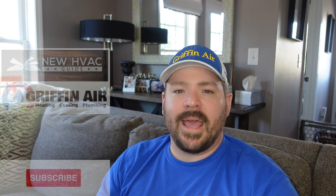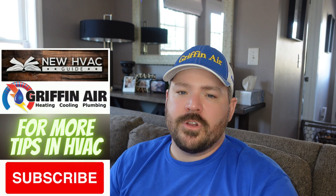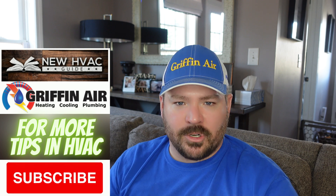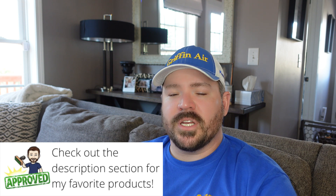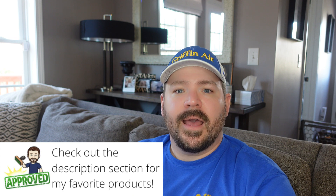For a lot of our customers that have batteries, I'll tell them every New Year's Eve or every Fourth of July — just pick something on the calendar you'll remember — and change those batteries. Every New Year's Eve I go through my house and change all the smoke detector batteries, and if you have batteries in your thermostat, that should be one of them as well. Just once a year, get fresh batteries in there and you'll never have to worry about it. Also keep in mind, a lot of thermostats have sensors — outdoor or indoor temperature sensors — that are also battery operated, so make sure you're replacing those batteries from time to time as well.